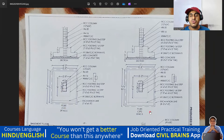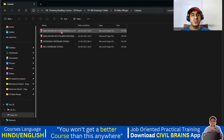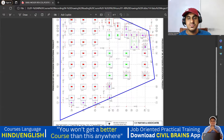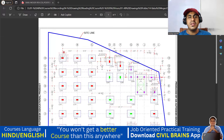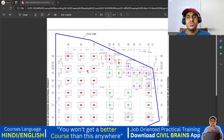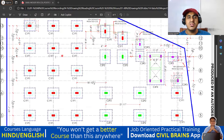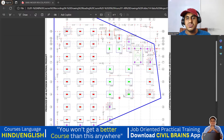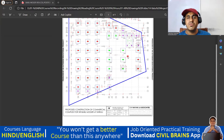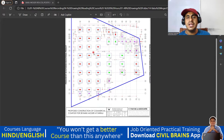They have given it here C1F1 and C2F2. I'll show you the column drawing. So this is the entire center line layout. ABCD are my grid lines, and from here the grid lines start from 1, 2, 3, 4. So this is the entire footing layout. You can see all these columns which are red in color — they are one group called C1F1. The columns which are green are C2F2, and the one which is magenta is C3F3. So basically we have three different types of footing: C1, C2, C3 and F1, F2, F3. This was the entire layout of that particular building.